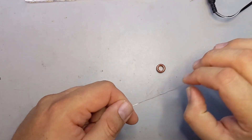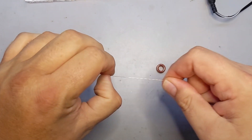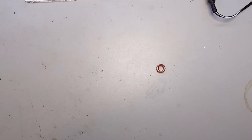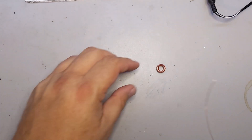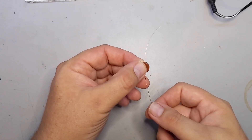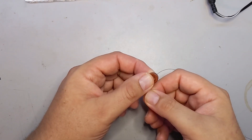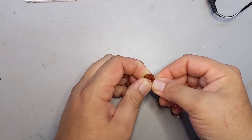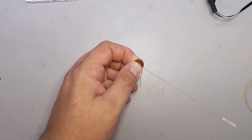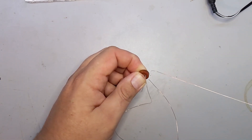The first thing I want to do is get rid of any kinks in the wire. To do that you just hold the wire and pull it like so — that should do it. Now it's got to be done right-hand turns, so we're going to start just as shown in the manual. I encourage you to follow along in the manual if you're unsure. I'm going to put it all through the toroid for the first turn and give it a pull, then pull out the rest of the wire ensuring I don't introduce any kinks, which is super easy to do when they're this long.